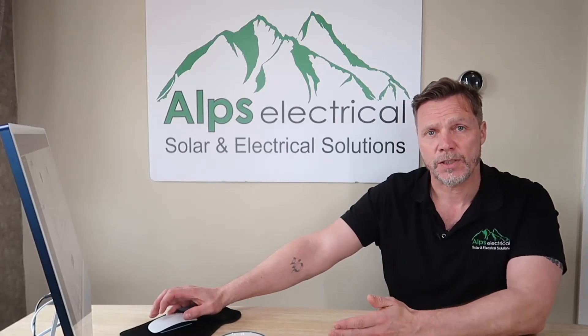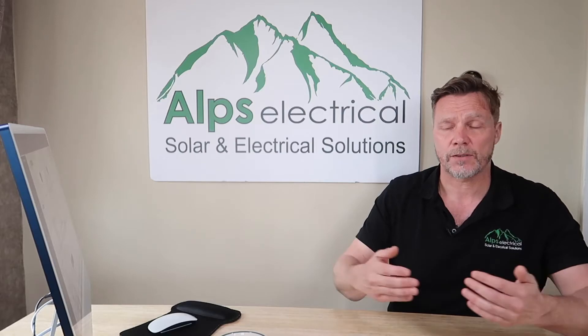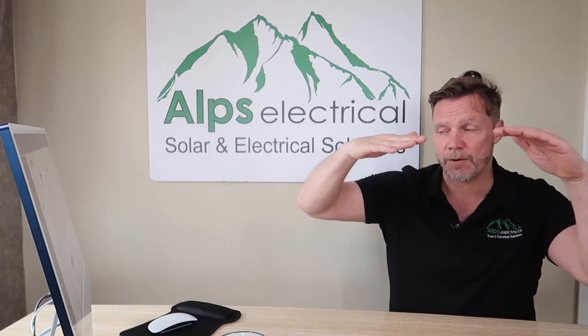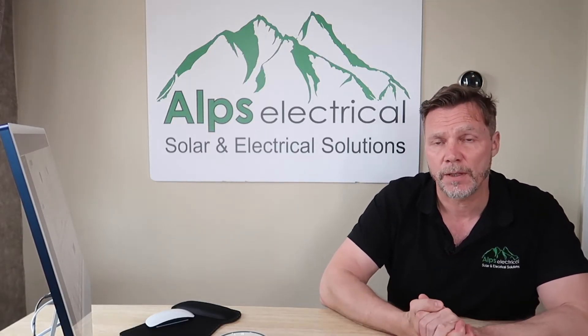Initially when I first got my solar system I started doing this just in the winter, but actually I'm going to do it all through the year. If the import and export rates are pretty much the same, there's no point taking the risk. You might as well start the day with 100%. And if the sun's out and it's a glorious day, all that's going to do is export at 14.3 pence all day long and top the battery up, so that by 4 o'clock when the peak time comes around — 4 to 7 — we're going to have close to 100% battery, which we can then force discharge.